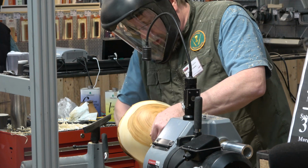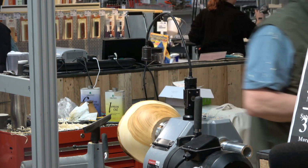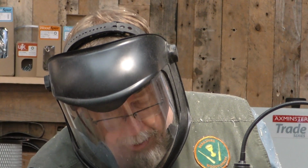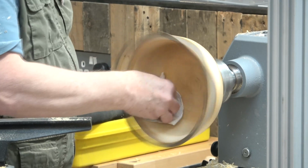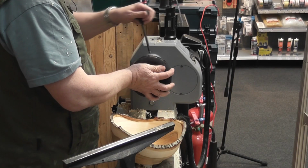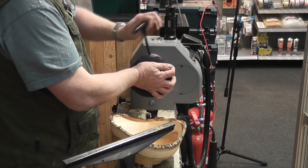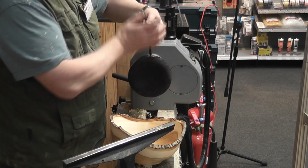That's right. The reverse chucking thing, I'm going to show you in a minute, the jam chuck is something I only made up the other week. I discovered I'd got an old wetsuit in the loft that my son had, so I've cut it up and used it to make some pads across the jam chuck. Quite effectively, I must admit. This may or may not work, because I've only done a small one and a bigger one. It's the first time I've used this one. That may be the wrong size for this, but we'll find out.